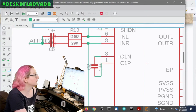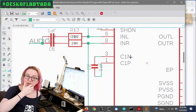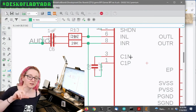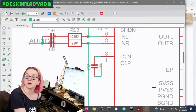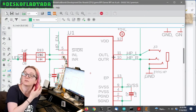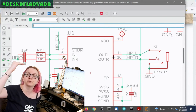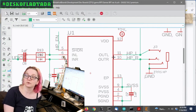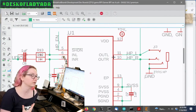And the way it works is, if you notice here, you're like, oh, what's this? There's a switch cap converter. Ooh, can't remember the name of the, not a boost converter. It's like an inverter basically. It allows it to generate a negative voltage by using a switch cap. That way, the signal that comes out here is referenced to a negative voltage as well as the positive voltage. From the 4-volt to 3-volt power, it's generating a negative rail so that the output is right centered through ground, which is super cool. You're gonna pay a little bit more, but usually these amplifiers are quite nice in general.